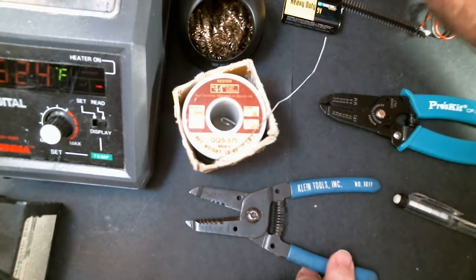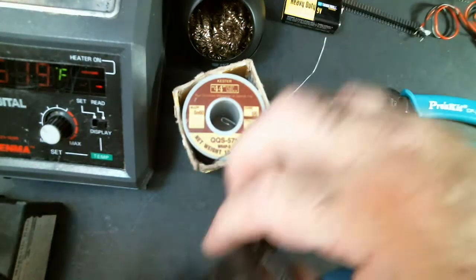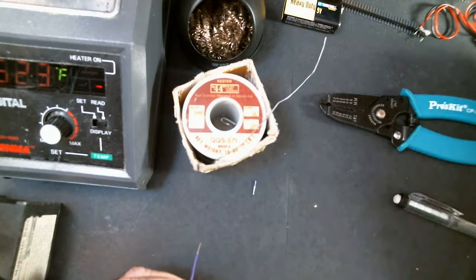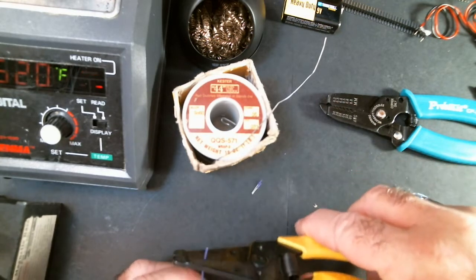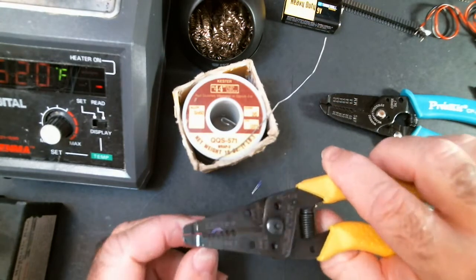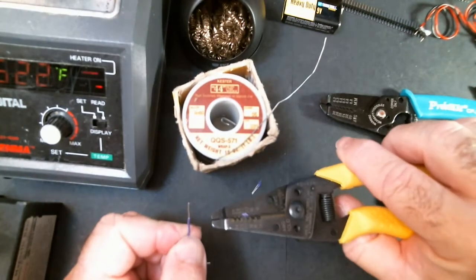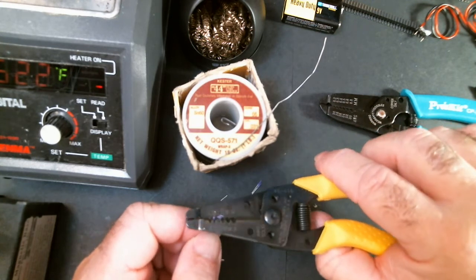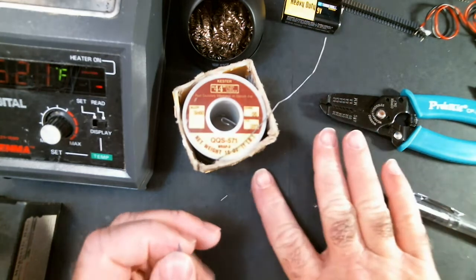If you try to strip something at 20, let me show you. So this here is a piece of regular wire — I'm going to cut the end off. You'll be doing this quite often. Notice I straightened it out; if you straighten it out, it makes life easier. I put it in here and you see how it's not really doing a good job. Now when I put it in correctly, I put it in straight and pull perpendicular. I'm putting this in at 22 — it says solid, this is solid wire — and it gives a nice strip. This is way too long; all your wires that go into the breadboard need to be three-eighths of an inch.